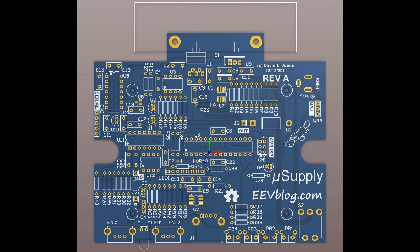But if you're doing a professional PCB layout to fit into a custom molded enclosure, really you've got to think about the whole 3D aspect of the mechanical packaging. Thermal performance comes into it, and things like that. You don't want stuff to overheat. If you're doing high-speed signal design, there's lots of stuff to do with transmission lines and controlled impedance, EMC requirements, and all sorts of stuff. But this was just a fairly simple board with a simple split ground plane.